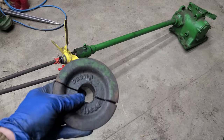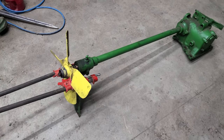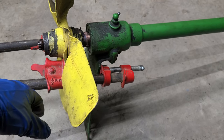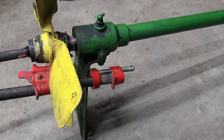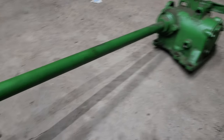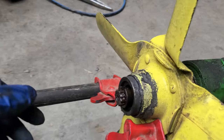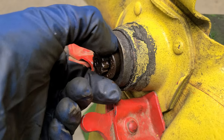I was able to get this off the pulley behind there — had to take a punch to the screws that were holding those halves on. You'll need to do this with the friction drives as well. I was surprised to find that there was compression on these two, but anyway, you've got to get some clamps. I've got two here on the bottom in order to reach there, not ideal — they're not perfectly offset from each other. Sometimes I've used my really long ones. If you've got a big C-clamp or something, you draw this back, and in here are these little keepers so we can take them out.